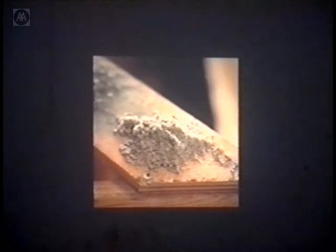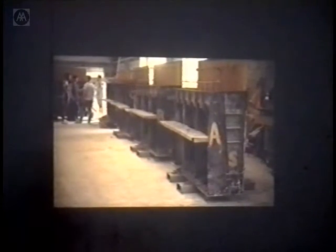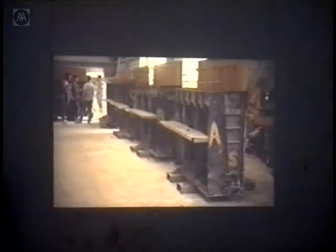And then they use this aggregate mixed with it, which is the same granite, graded down to very fine material, and because they thought that wasn't sufficient, they put in some actual sand as well. So they used three aggregates, plus the cement and water. And these are the moulds that he used, a whole series of them. You see the idea, the bit with the S on it is where the concrete is put. The problem is the elements are cast upside down. So place concrete up to that level, vibrate it, and then they put the other piece of the mould onto it and bolt that on to form the downstand edge.